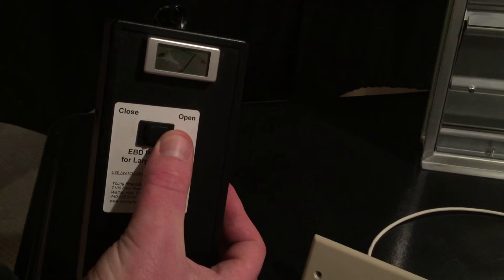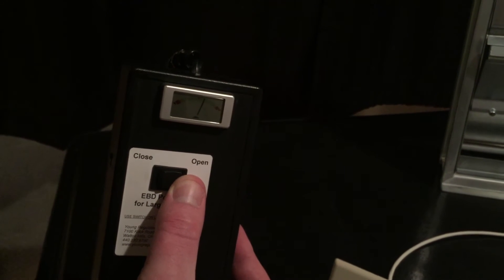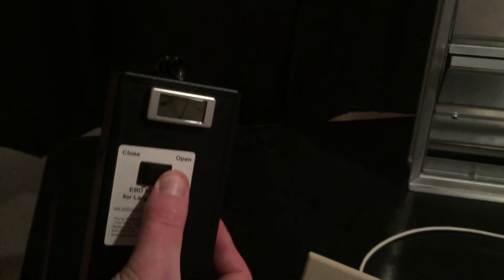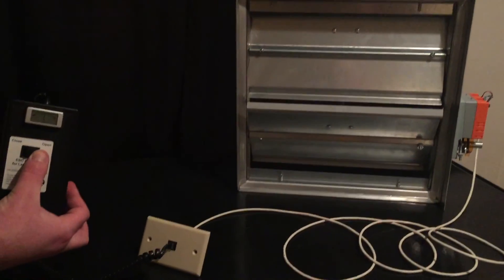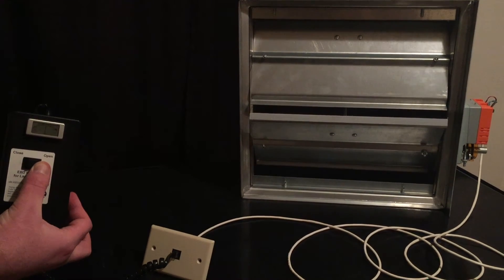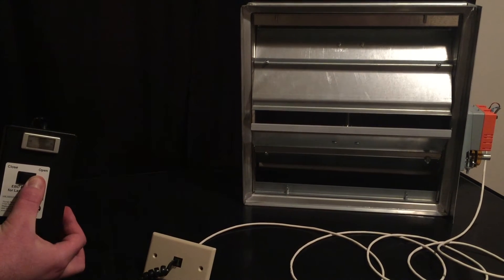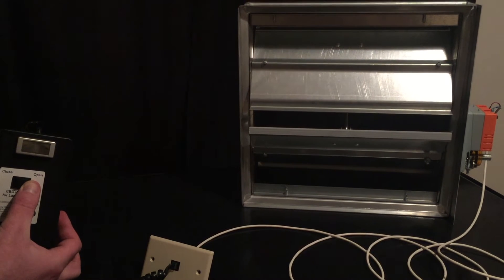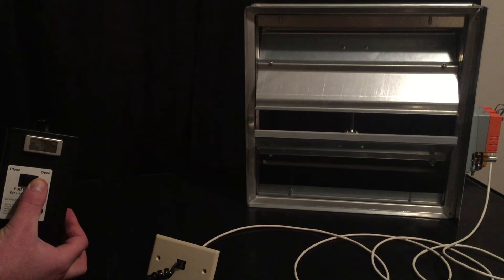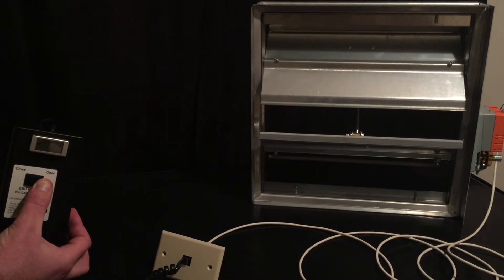Only the Young Regulator EBDL Positioner Power Pack provides a blade position indicator via LCD meter. This was designed so technicians don't have to play a guessing game when balancing each damper at a job site, saving labor time which ultimately saves money over the life of a building. Each EBDL system is also comprised with designated lengths of plenum rated five conductor electronic cable that reach up to a thousand feet and is flexible enough for the contractor to feed through congested wall spaces. The cable connects all the dampers to terminations that go up to 12 ports, providing the technician with convenient balancing stations to quickly balance all the dampers at a job site with just one positioner power pack.